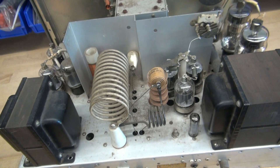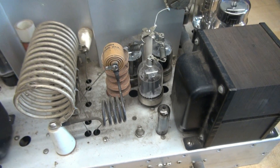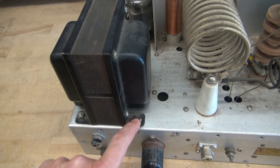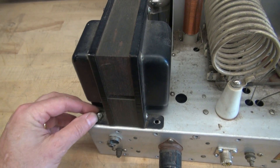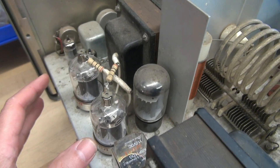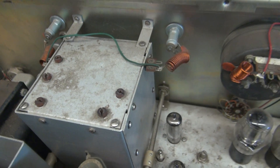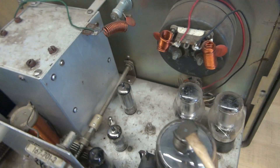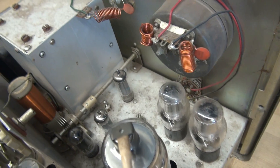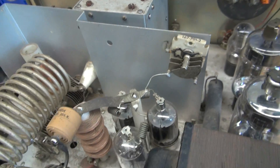Here she is topside. As you can see, we've got the little pop rivets in here indicating that this is a factory-built unit. I noticed that this transformer here is missing some hardware and this guy's loose, so I'll bet that's been changed. Here's your modulators, here's the VFO - hopefully without that Chernobyl resistor in it. A pair of 3B28 rectifier tubes instead of the 866s. All in all, she's a little dusty and dirty but it looks complete.